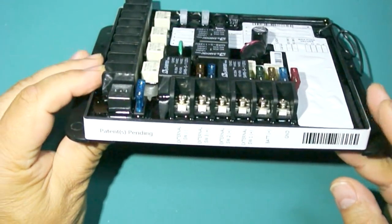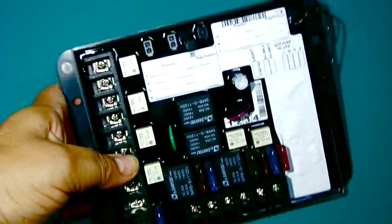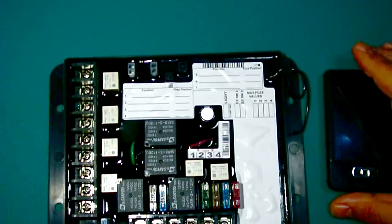On this edge of the board we have controls for external switch minus, external three plus, external two plus, external one plus, battery, and ground. Then we have function one minus, function one plus, function two minus, function two plus, function three minus, function three plus, function four minus, function four plus. Then there are two terminals labeled CAN, which I believe are CAN bus.